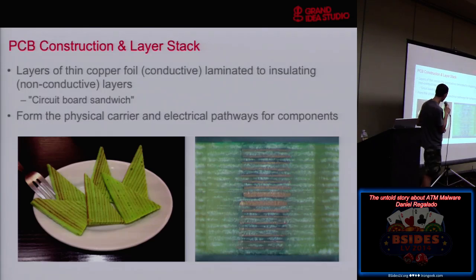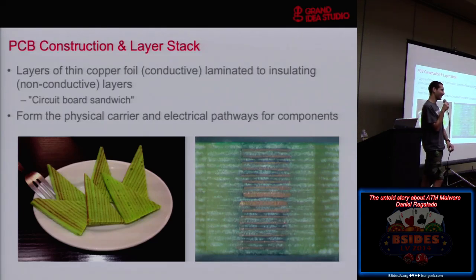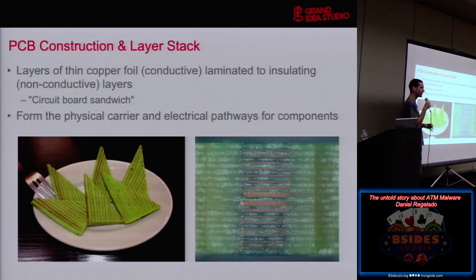Different layers of material. Here's a cross-section of a board — 16 layers. Boards can go from a single-layer board with copper on just one layer, to a more standard two- or four-layer board, up to 16 layers. The largest layer count that's practical right now is like 80, which they call ultra-multi-layer or mega-multi-layer. You might see that in high-end server equipment or some military device, but normally not 80 layers. Sometimes in low-volume test equipment for testing chips, you might have tons of layers, but normally not.